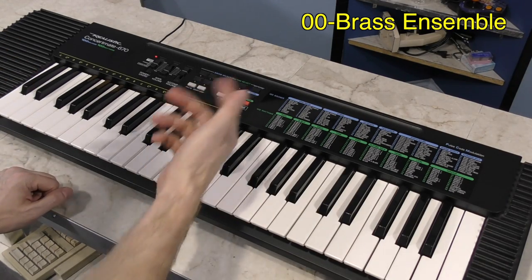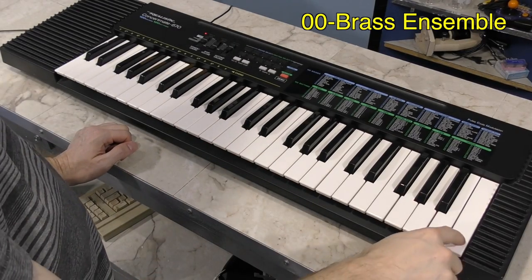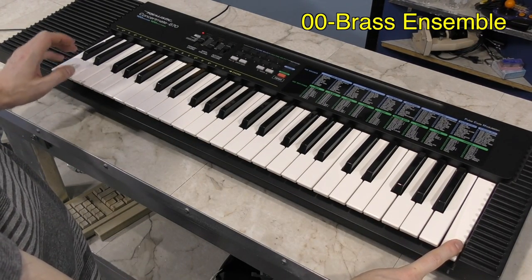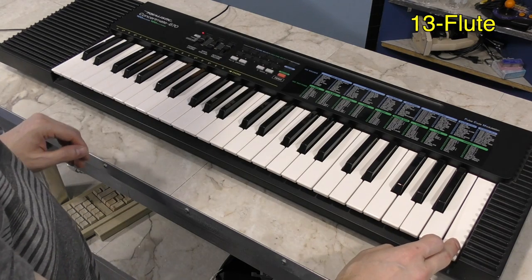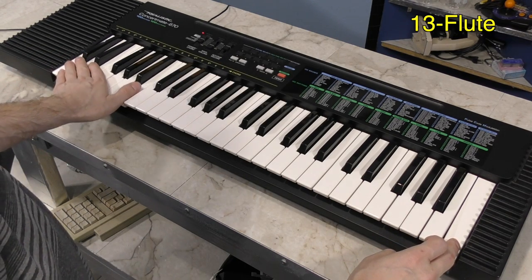Piano would make so much more sense. So, I'm going to do a polyphony test real quick by holding down the high note. And it looks like I can play three other notes before it cuts off. So that's four voice polyphony. However, let me try another instrument like this flute. Okay, so on simpler instruments, it looks like there's an 8 voice polyphony.